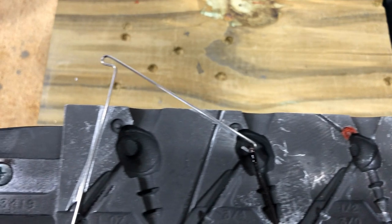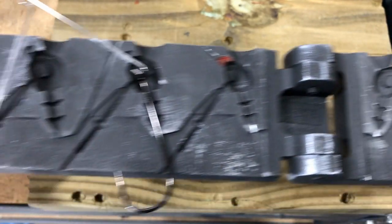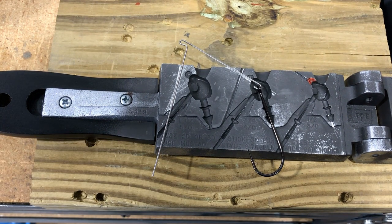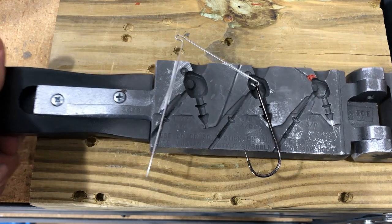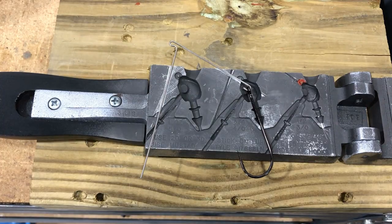Filing's done — not without its fair share of screwups. Even when you take it slow and use the file, you can get off a little bit. I got in a hurry in at least one spot and got to digging in, but it's working. It's clamped in. She's all filed down. You can see where I got off a bit, and even more so over here, but it does fold closed, clamps up nice and tight. I already ran a test pour and it turned out really nice. So now we just need to make sure we put our pin in — otherwise it's going to shoot out and you won't get a full pour for that pin.